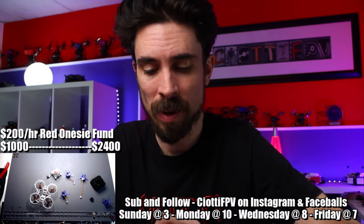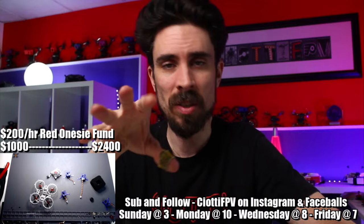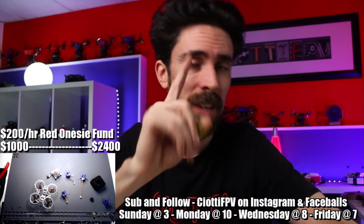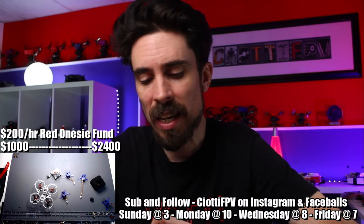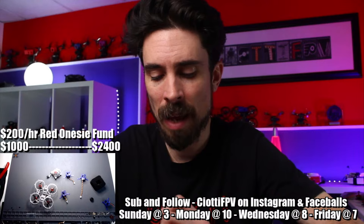So the problem you're going to run into, Brad, is there are a bunch of 1S AIOs that have VTXs and receivers and whatnot built in. It's tough to find a 2S AIO that has a receiver and a VTX built in. And with a tiny lifter, technically, it's making enough thrust where it's not that important to have everything on one board. You could absolutely run an external VTX or even an external receiver and be totally fine.